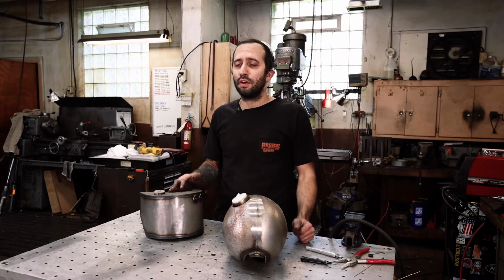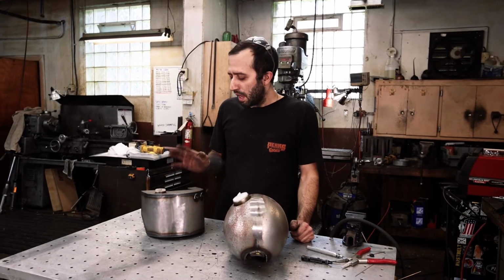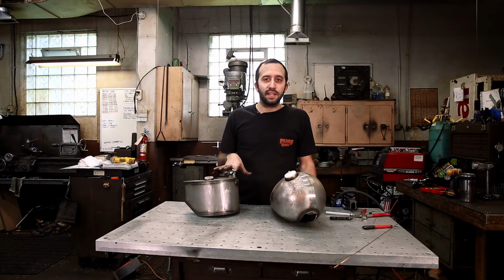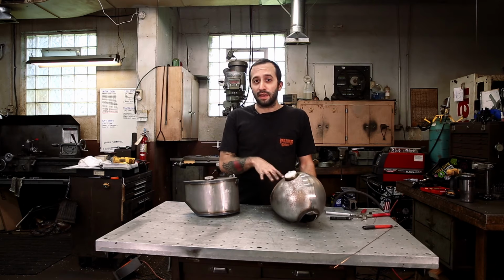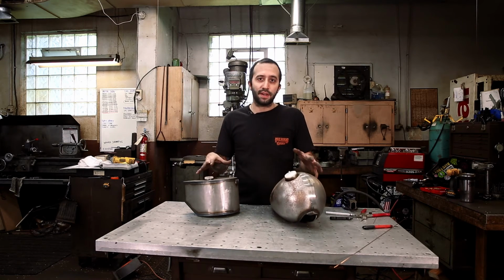So the last thing to do before we send this out to paint is pressure test your oil and your gas tank. I already showed you how to do this in a previous video, and there's a link on your screen for you to be able to click and watch that video. I'm not saying that to expect any leaks in these kind of things. I'm just trying to tell you that this is the time to find them, because there's no easier time to fix a leak in either of these two parts than right now when they're bare.